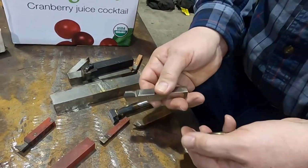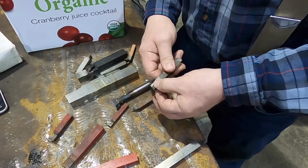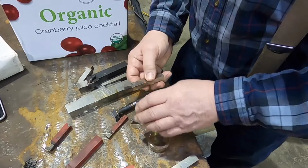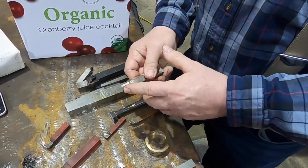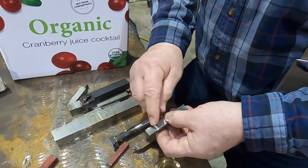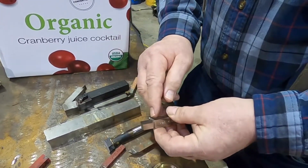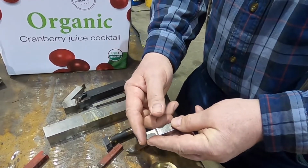That's the only time I've really seen the shoulder have an advantage, is when you're extremely overworking the tool. Right. The other advantage is, though, if you're a manufacturer of these, the people placing this in, it's always in the same place. You know where the carbide's going. You could make this with a bigger piece of carbide, just lay it flat on a surface that was lower, and then come back and grind, but you'd have to grind a lot of the carbide off to come to the same location.